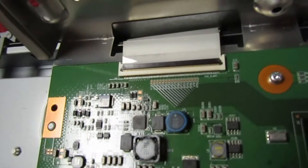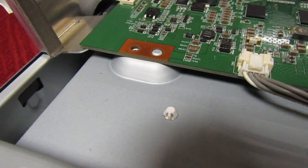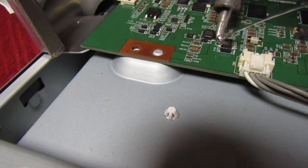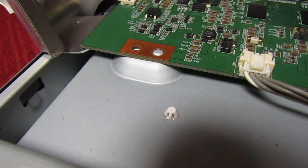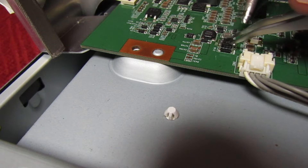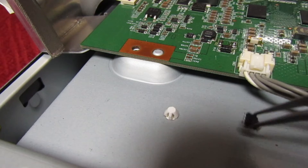What I'm going to do is just flood all these pins with solder and then lift it out with a pair of tweezers. I can just about get the camera in to do this. Flood it all with solder, then take a pair of tweezers and just lift it out — just like that, job done.